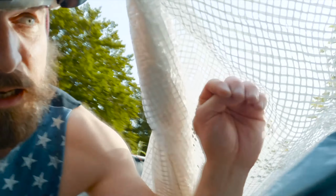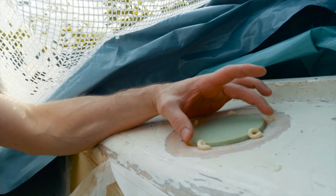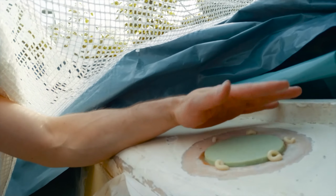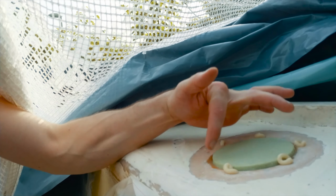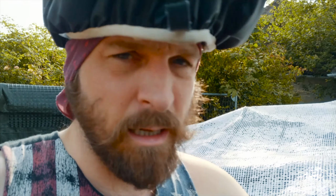Right, on top of the roof then, you see, we've got the foam sticking up through, and that's all epoxied in strongly, and it's epoxied underneath, and then I've squeezed up through the holes, little sausages, so they're filled up. So I'll just take the tops of those little sausages off, and then sand down through the foam, which should be quite easy, and they'll be ready to epoxy over the top, and they'll be done.